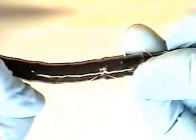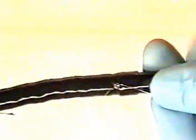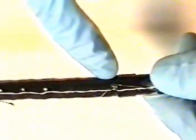Now your binding is tight with your turns and should be airtight, as not to allow any air to escape from the glue job bending joint. We now have 2 bindings, one at the distal end, right up against the distal end hood or CC cover, and the second where the insertion tube meets the bending section. Again, cut off the excess thread, at least 1 inch.